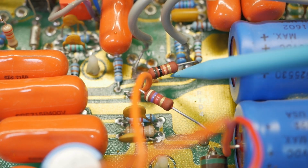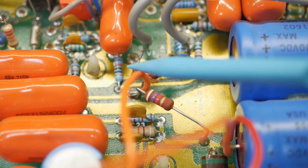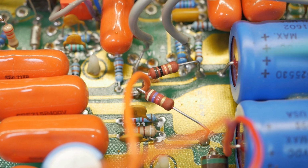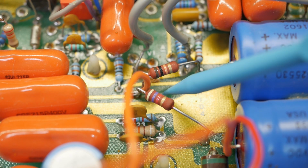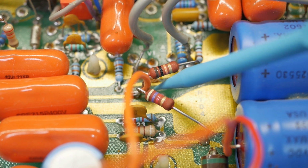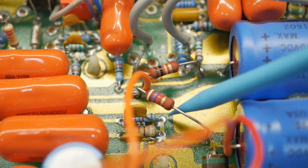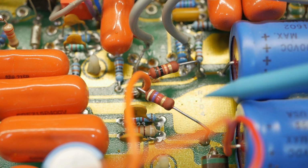I'll be removing this voltage divider, getting rid of this wire because we're going to get rid of that extra stage which is feeding off this. And I'm going to re-establish that trace. Might have to run some wires in that area because they've scratched it up off the board. Reinstall that resistor, just going between these two nodes that connects down to there.